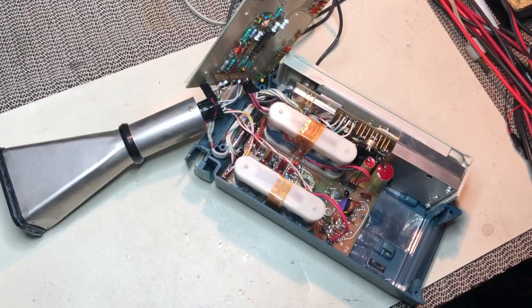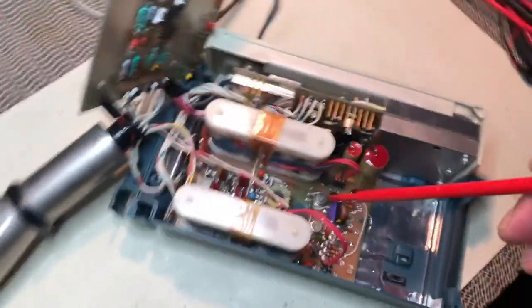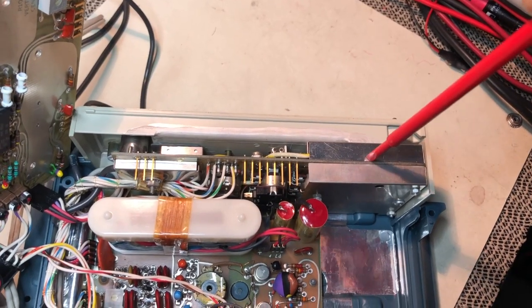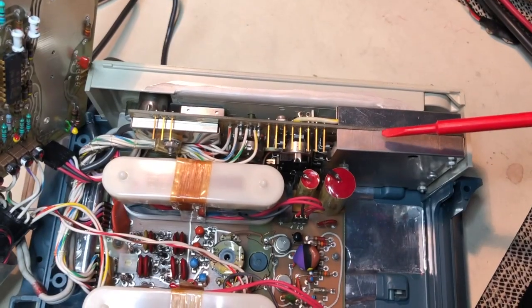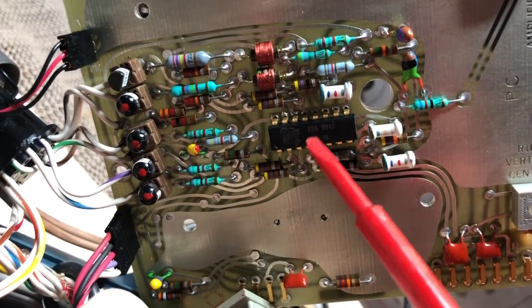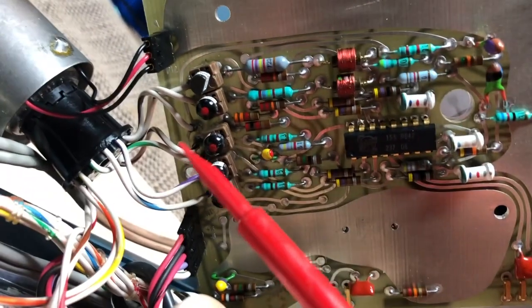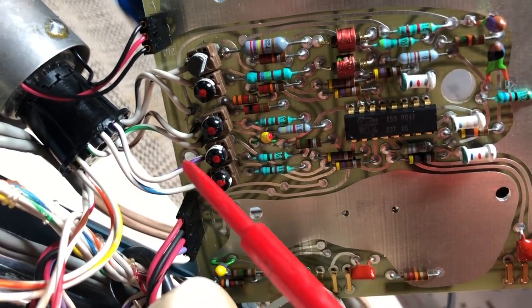I'm going to take out the CRT. There are just three basic units inside: the amplifier board, the power supply board, and the input board. The input signal comes in here, goes through the attenuator, gets first-level amplified, and then that signal is passed on to the amplifier board. This section also contains the sweep generator IC which generates a sweep, trigger, and unblanking signal, then passes the sweep plus unblanking to the amplifier board. The amplifier board contains two amplifier sections which amplify the signal from the input board and drive it to the CRT, using four output transistors for driving the differential vertical and horizontal signal.